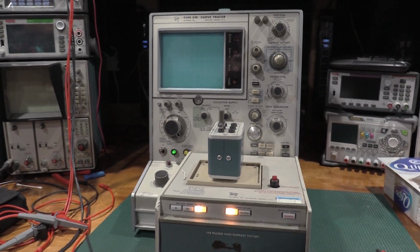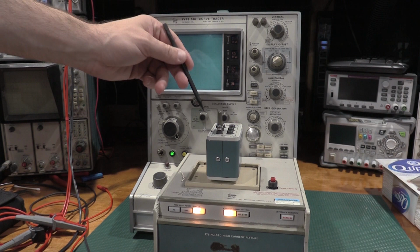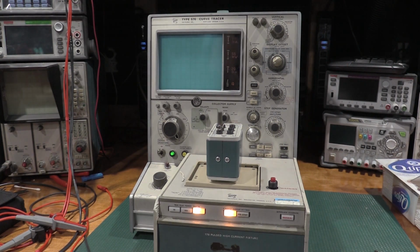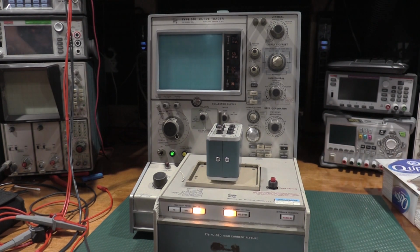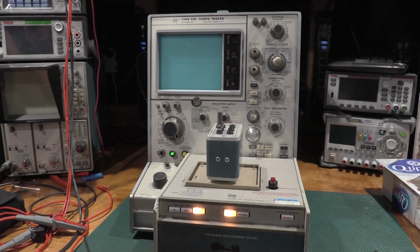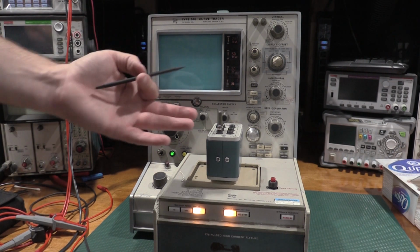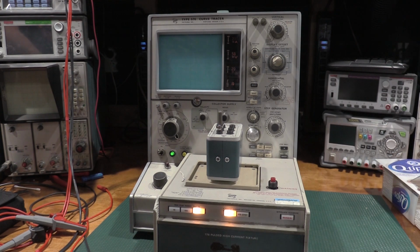The other thing that I ran into was, so I bought the load resistors, figured, hey, they're load resistors, they should be good. Their tolerance is 0.5% at 4 watts. So these are some pretty stout resistors in here. And we'll get into that in a second because I had it set up to do the first test, and I just wanted to validate the standard resistors and figure out, you know, everything's working, is it not working, what's going on.